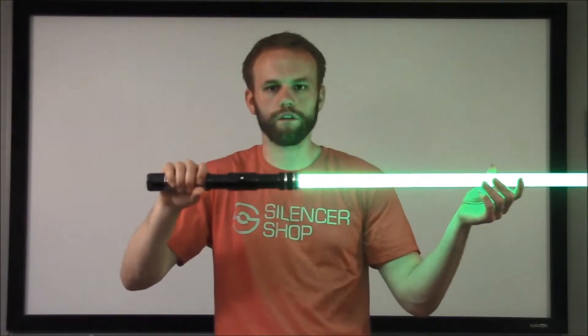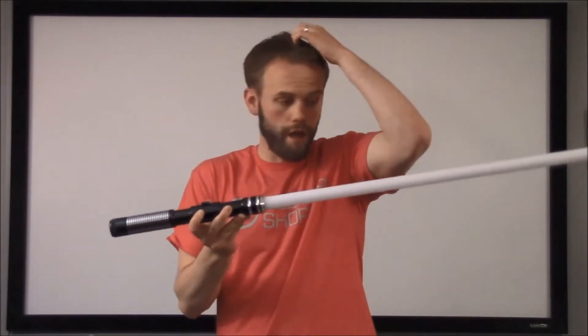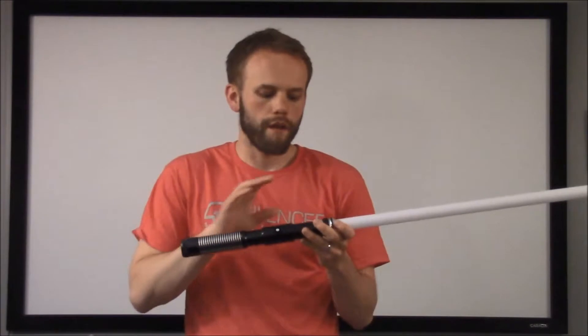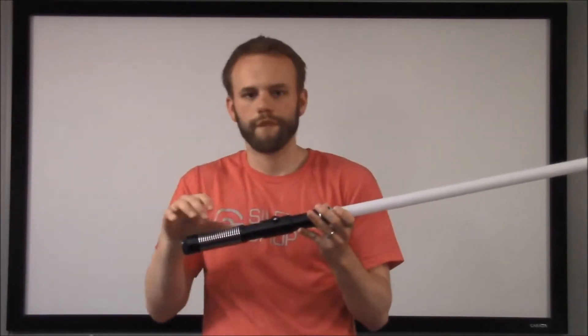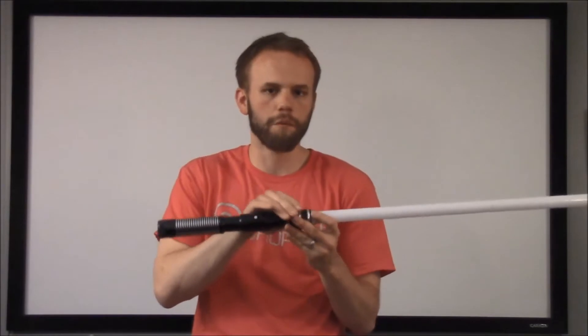The LED in this guy is what Ultrasabers calls their Consular Green. It's a 1-up LED engine 5-watt unit from what I can tell. Not the brightest thing out there, but honestly, unless you've got it right next to something like a Cree XPE-2, you're probably not going to know. It's brighter than I expected. The LED is probably pulling around 1 amp — that's what most green LEDs tend to expect, with a forward voltage of around 3.7 volts to get that 1 amp of current.